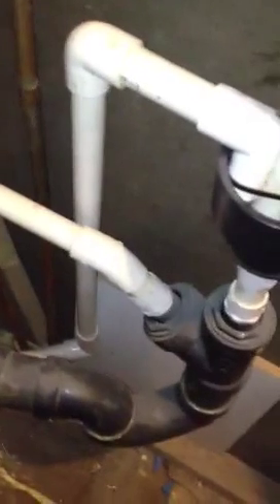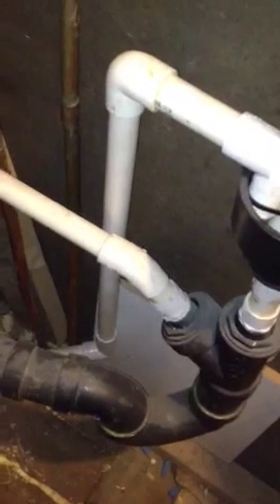We've got all those drains. There's a condensation drain which is pretty acidic — that one's tapped directly in because it's going to evacuate some condensation water when the boiler runs. And those two others are put in a reducer so you can see if those pipes have water inside them. If they're evacuating water, it means there's either an over-pressure condition inside the boiler or the safety valve is defective. So the homeowner can check very easily if those safety valves are leaking.